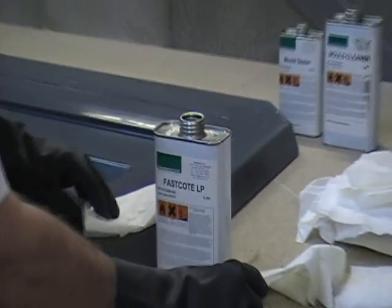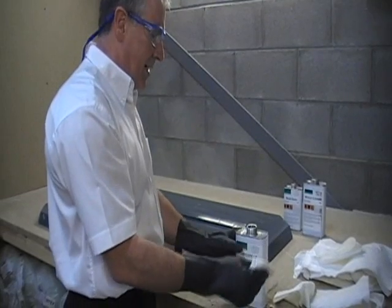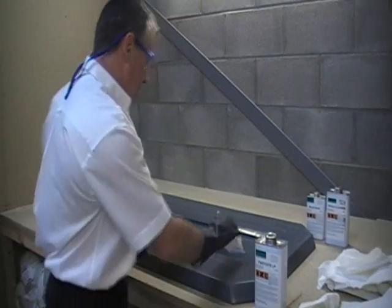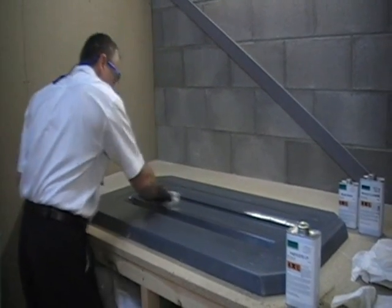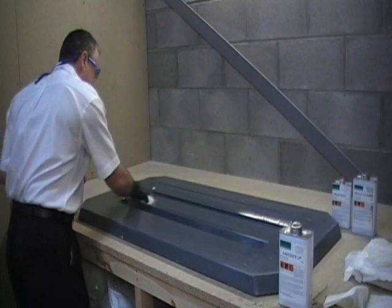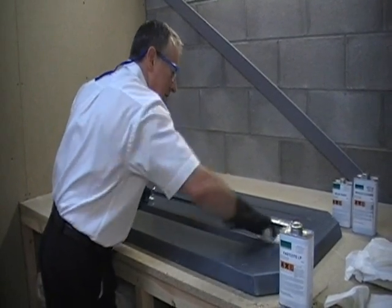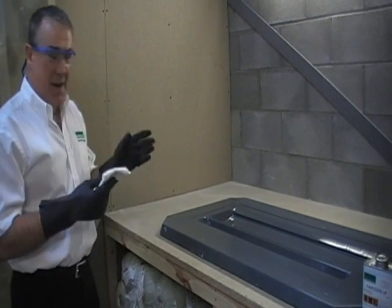The Marble Coat Fast Coat has been developed so that all you have to do is take one of our special lint-free cloths, wet the cloth up, then put the lid straight back on because it cures using atmospheric moisture. Wipe a wet film over the mould. With a bit of practice you'll be able to put a wet film down which dries in about 30 seconds at 25 degrees centigrade. If it's warm you can let it dry a little quicker — about 20 seconds; if it's cold, allow about a minute. Apply a wet continuous film, allow it to dry, and that is it — it's as simple as that.